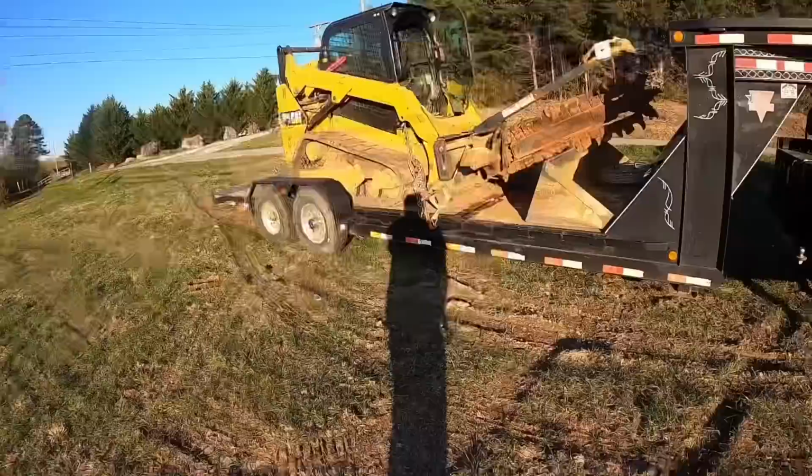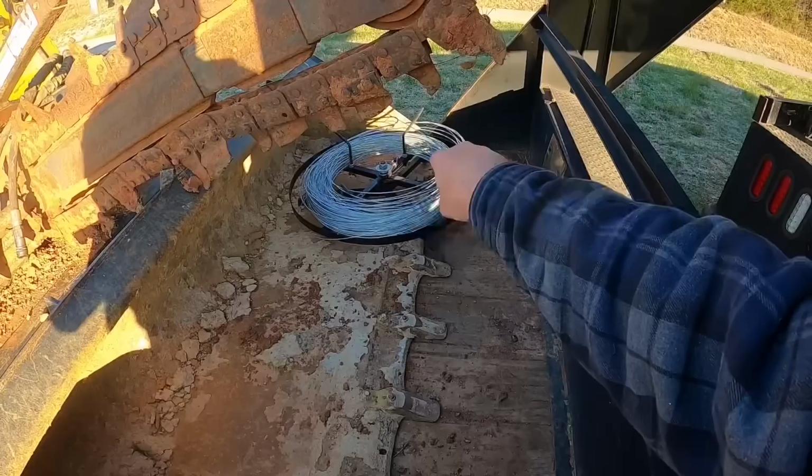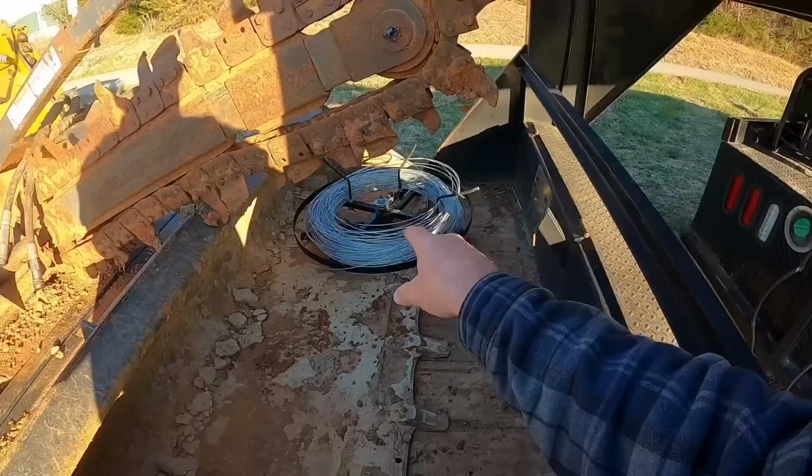And also, I'm gonna try something different today. I've got what's called a spinning Jenny sitting there, and that's originally designed for unspooling high tensile wire. But I'm gonna adapt that today to see if I can unspool this PEX pipe with it. If you've never unspooled PEX pipe, especially a 500 foot roll, which I'm hoping to get instead of 300 foot rolls, it's a chore, especially when it's cold. So I'm hoping that's going to work for me today, and we'll see how that works.